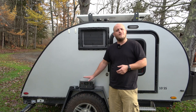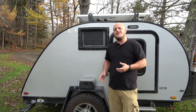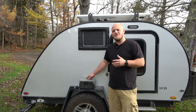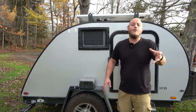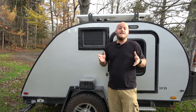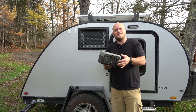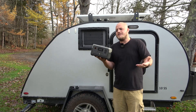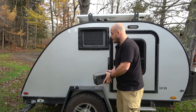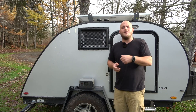It doesn't bother me as much on the AC side, but on the DC side where I'm running a fridge — this is a lithium iron phosphate battery and I'm almost certain it's 12 volts — I'm confused why they're regulating here when they could have delivered more watt-hours through this port. The saving grace is the upsized 256Wh battery, so with those efficiency losses you're still getting more runtime than pricier competition. It's a downside with a silver lining.